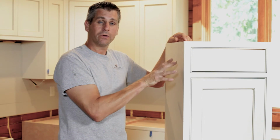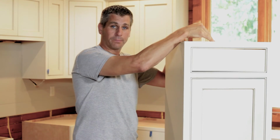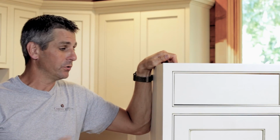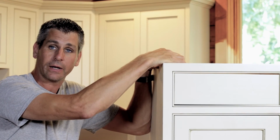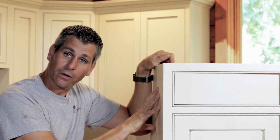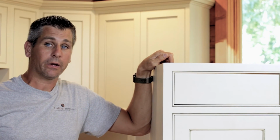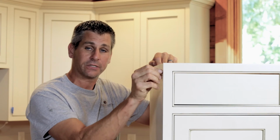So be aware when you're doing your finished end options for a standard finished end, it's flush or exposed. We have other videos that talk about other ways to finish off the end of a cabinet. You can do an unfinished flush end. Some people will ask for that, so they're not spending money on finish, but they want a thicker plywood end. We can do an unfinished flush end on the Advantage box. You can also do applied door panels. We can do integrated end panels. If you're doing a custom wood species like walnut or alder or pine, this would be a skin. You wouldn't get a flush end. You'd get a 1/4 inch skin and you would apply it to the side of the cabinet to create the same kind of flush end look, but it wouldn't come already finished.